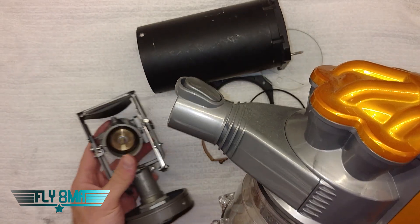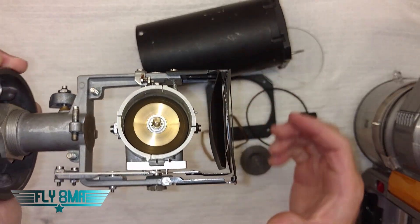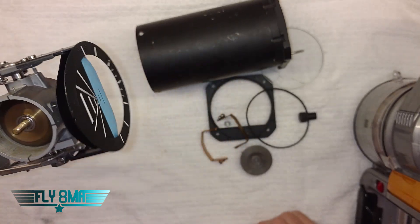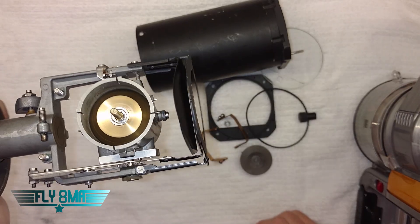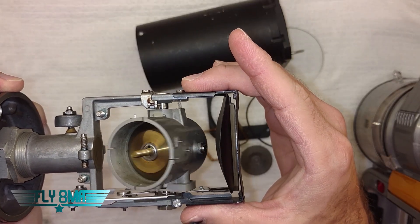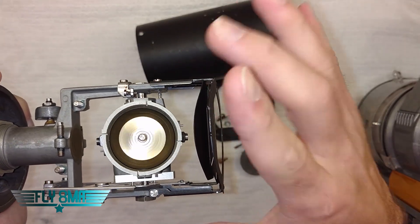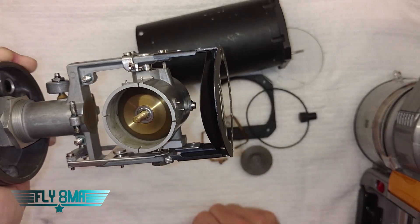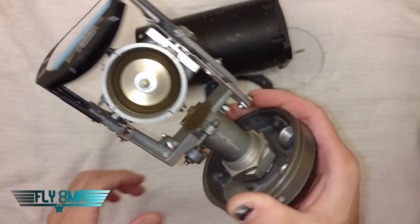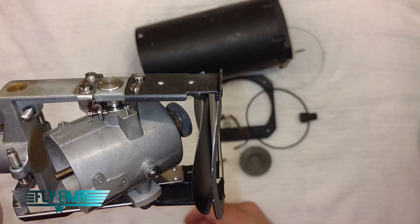We'll use our handy Dyson to create some suction and see just how fast we can spin this gyro. Now the gyro wants to remain rigid in space, so as we turn, rotate, bank, and pitch the airplane, it wants to remain rigid in space giving us accurate indications as to where we are relative to the horizon. You can see that if I actually try to turn the instrument, gyroscopic precession converts any turning motion 90 degrees in the direction of rotation — it actually makes it want to pitch. That's why if there's any resistance in the instrument it won't indicate accurately; it needs to be nice and free-moving around that axis with very precise bearings. With aggressive movements like a full loop, the instrument is not going to be happy and will start giving very strange, odd indications.